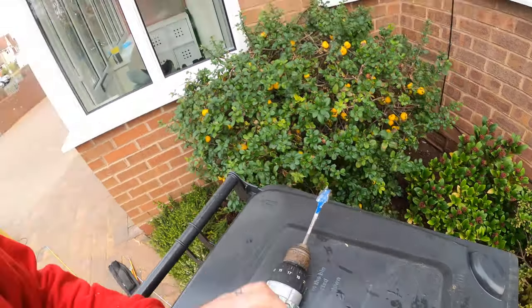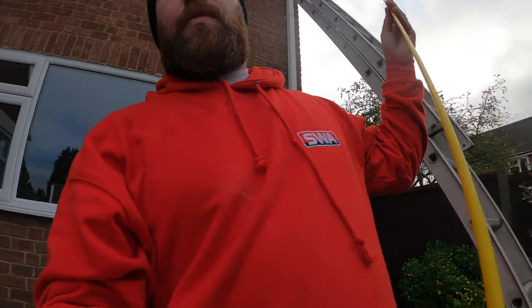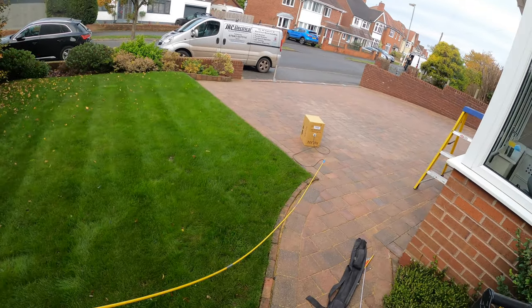First camera. I've drilled a 25mm hole in the soffit. I'm alright drilling these because I know it's wood — we've worked here before. But if you do yours, just be careful because a lot of plastic soffits are covering asbestos. There are loads of them that are asbestos, by me anyway. So I've drilled it out, Scott's up there making his way round, put the CK rods on, tape the cable on, ready to go. I'll get up there, fish it through, hopefully Scott finds it — hopefully faster than before. I'll get up the ladder now and bust them through.